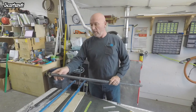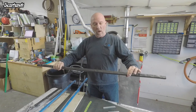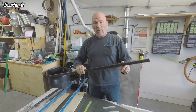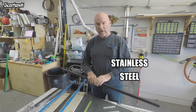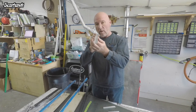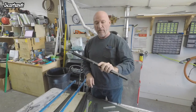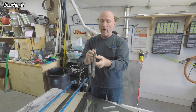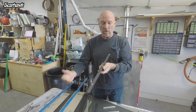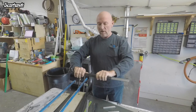The end result is this channel that fits right inside the other. These now become a single piece using 3M Scotch Weld, a 3M epoxy adhesive — the DP-190. Once I applied the glue, I used rivets about every five inches, steel rivets. Inside the channels I also put some 0.025 aluminum, and that's going to give my rivets something to bite into. The final result is two pieces of channel, three plies of carbon, one ply of Kevlar, one on top of the other, glued in place with structural adhesive and rivets about every five inches to make it one integrated piece. It is as tough as can be.